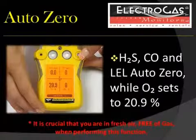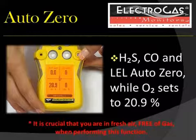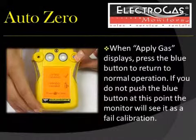All 4 sensors will again be displayed. The oxygen will be set to 20.9 and all other sensors to 0. It is critical that you are in fresh air, free of gases and toxins when performing this function. When "apply gas" is displayed, you may press the blue button to return to normal operation.